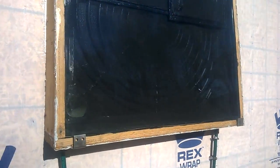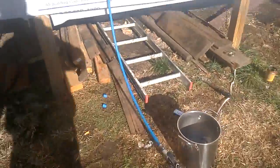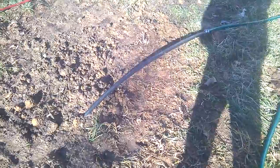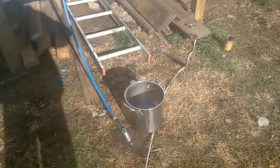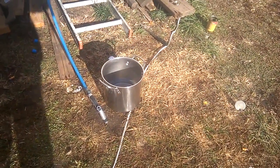All that is, is the line running through this solar heater. It's coiled up around inside of that thing — it starts right here and just runs around, keeps circling around, and comes right back out right there. I got it running to that little hose. I'm gonna put a frost-free spigot right there. So the water line is just running right out of the ground, going into this thing, circling around, and coming right back out — and it's coming in that pan at 104 degrees in 20 minutes. That's pretty good.